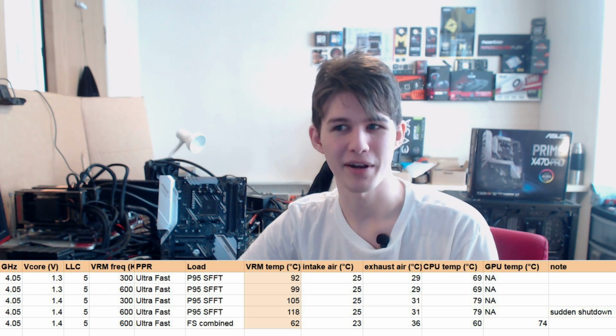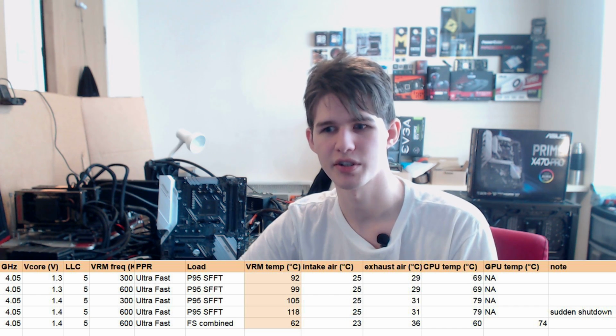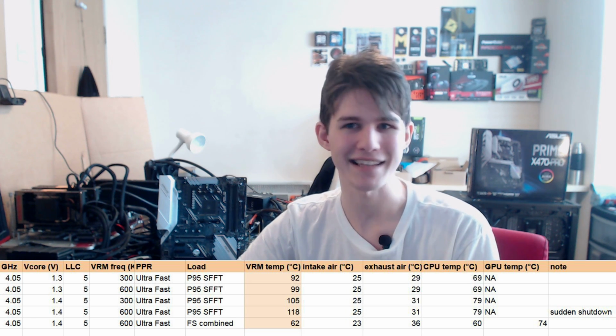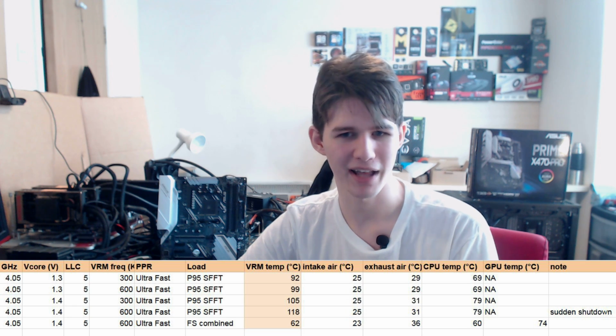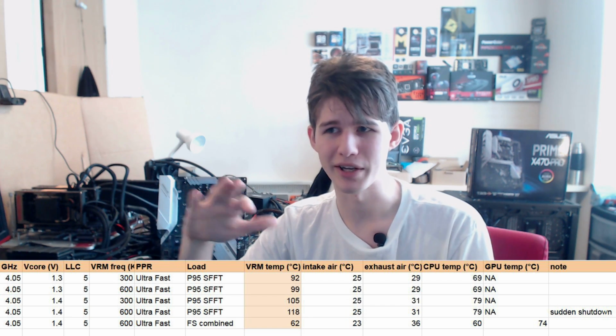The reason why I would max out around there is because already at 1.35, the power consumption is just really high. But at 1.4 volts, it is insane. The CPU easily hits like 104, way more power consumption than an R7 1700. In fact, I did a check that my CPU temperatures weren't anomalous, because they did seem kind of high for 1.4 volts, and using the Crosshair 7 Hero, I had to set the 1700 all the way to like 1.45 volts before I got the same kind of current reading as the 2700X.